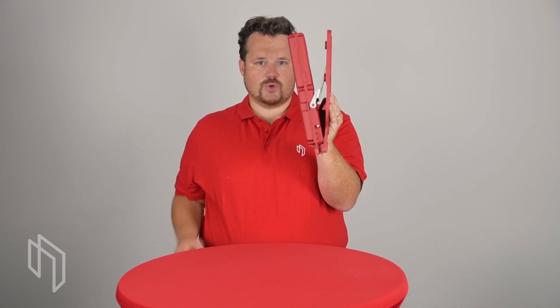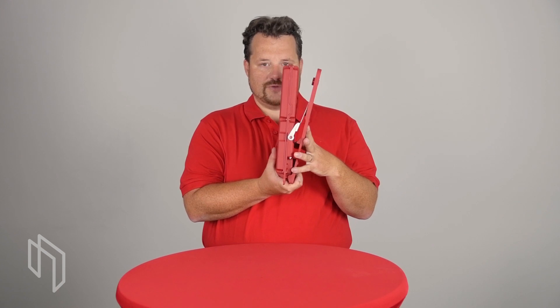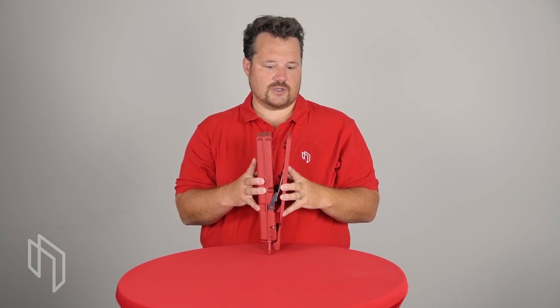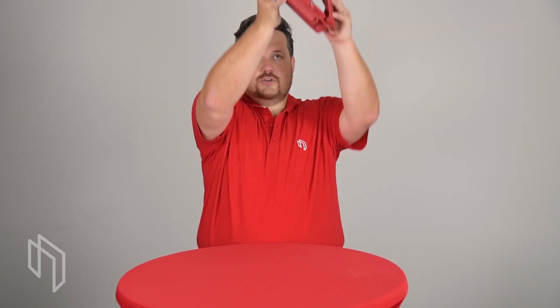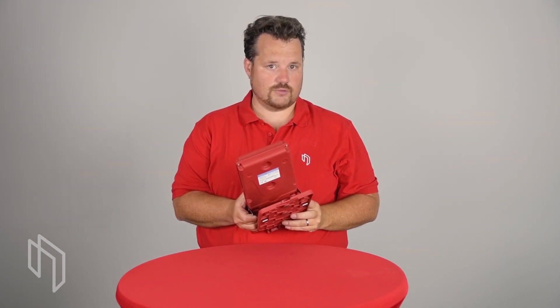The question is what should you normally do? I would always put it up somewhere if you can, because you want to get over the heads of your spectators. Whenever you assume that somebody could be standing in front of the box you should put it up high enough so that it can look above the heads of your spectators, because UHF does not travel through the human body.